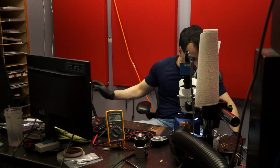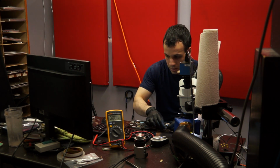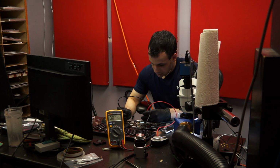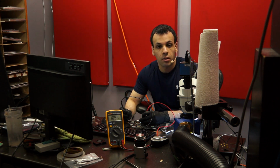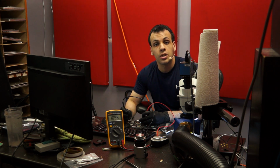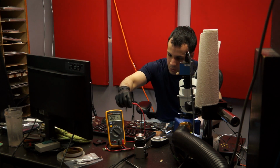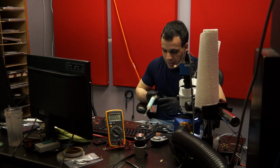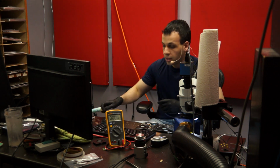Alright, so let's see what I get. I heated the capacitor up. Plug this in. And check that out. 1.097 volts. 1.097 volts. And again, this is why this whole oven thing enrages me. It's because so many of these components can work again temporarily, even when they're clearly destroyed, if you just fucking heat it.